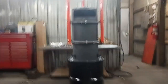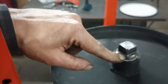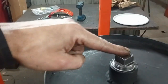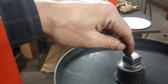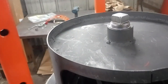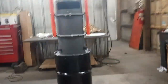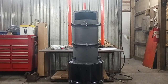Well, yeah, let me show you what I was wrenching on here. This is a through-hole seal housing for an automated grate. If you go to that option, it's basically a spindle shaft that goes through here, and then there's some linkage that attaches to an electric motor that runs on a timer, and then you can agitate this grate. That may be desired. Just depends on the application. Maybe a higher demanding application will require that to keep the flows flowing fast enough to keep up.